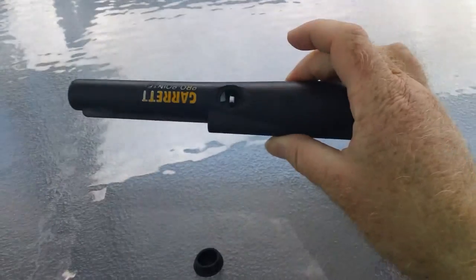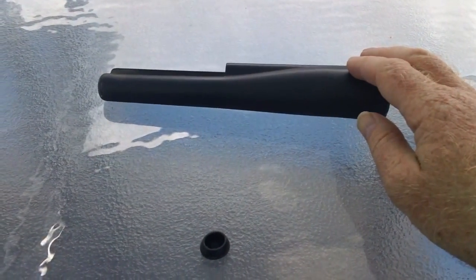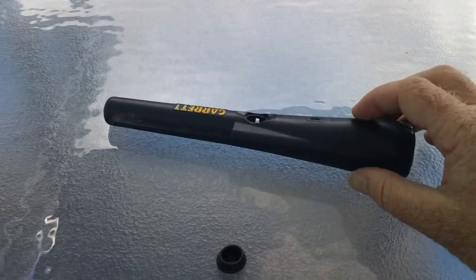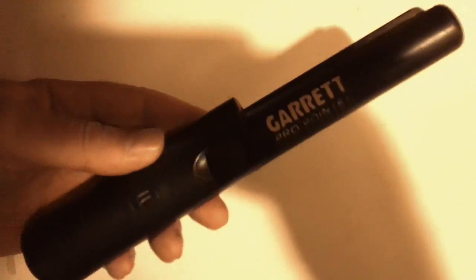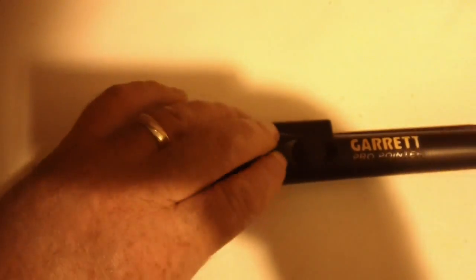Okay, well, I'll pull it apart again to see if we can find out. So those earthing wires, obviously that plastic's not quite insulating it or getting where it needs to be. I might try some epoxy or something like that, just to keep them from giving that short, but it's better than what it was. I thought, what the heck, I pulled it apart again, and I repositioned the plastic, and what had happened, it moved back, and as you could imagine, trying to push the board in, it allowed the wires to fold over, and they were just resting on top of the components.